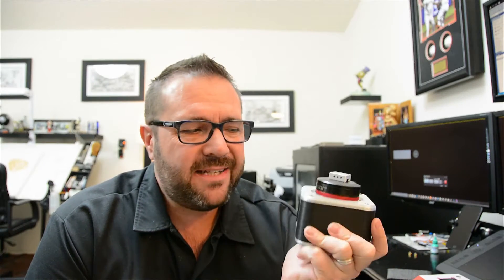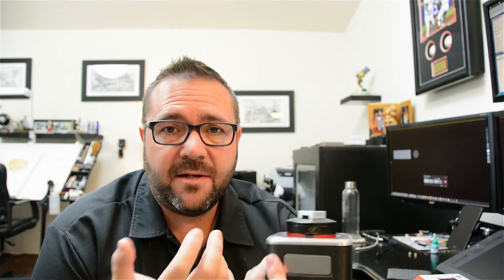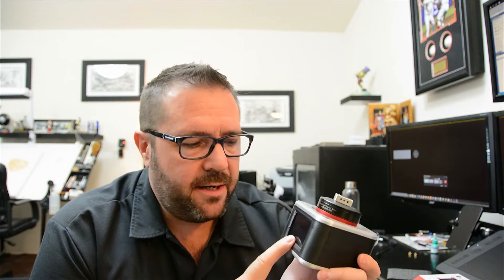So let's talk about SteadyShot Bot. Last time we visited this, we tore apart the gimbal arms and redesigned some of the models to route the wires up through the frame to the accelerometers and shutter trigger boards. Aside from the electromechanical aspects, let's talk about some of the technical and development aspects of this base unit. As you recall, we etched the circuit board on the Nomad, applied a solder mask, put a stencil on there, installed the components, and we installed this display — the 4D Systems Gen 4 Picasso 2.4 inch display.